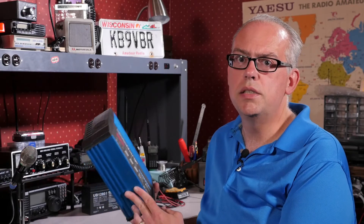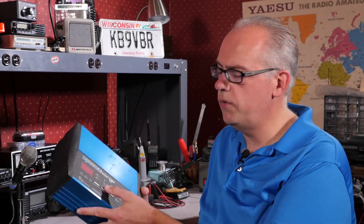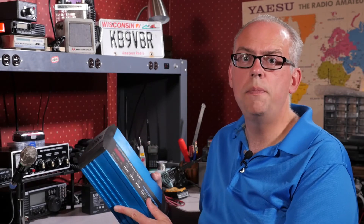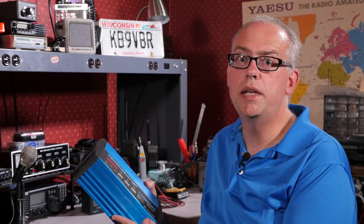You find these in boats to keep the marine batteries charged up. It works fine for that application, but is kind of so-so for the amateur radio application because it's only one and a half amps. If you use your station sporadically it keeps the charge fine, but with heavy use it certainly lags. So then I moved to the more familiar smart charger, which works with a wide variety of batteries including lead acid flooded, sealed gel cells, and AGM style batteries. It has a selector for different charge rates and charge times. It works great as a charger, but does not work very well as a maintainer.